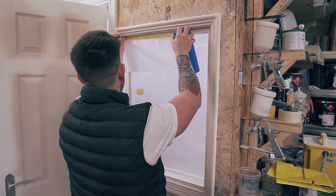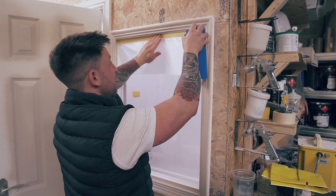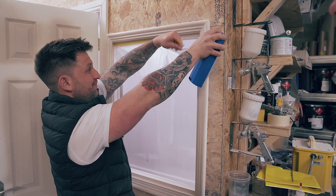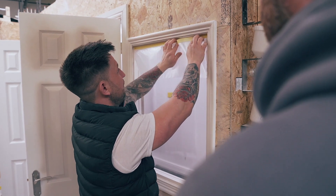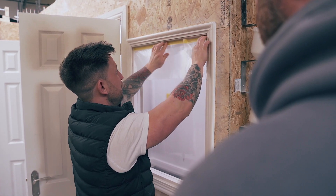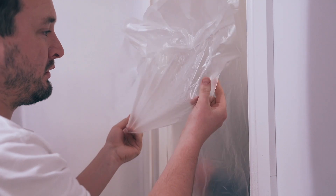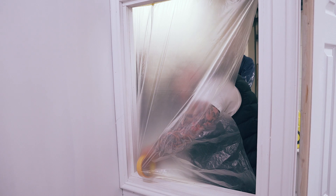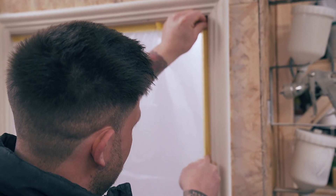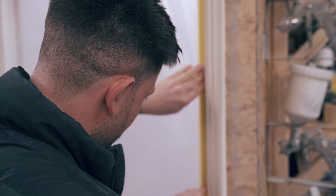Put your tape up, match it at this end, and come just slightly over. What I do now is fold it back to that line, then marry it up in the middle. The easiest way to do it is to pull down what you need, tack your first corner down, then just tuck in behind whatever you're not using, because you've got that nice and tight down there now.